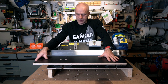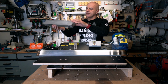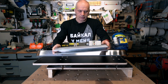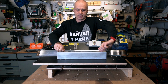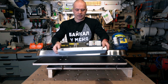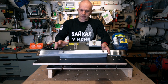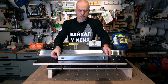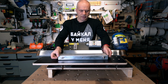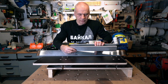The third upgrade is a grip, a hold for a runner. I've been using an aluminum profile. That's a two-piece aluminum profile. Both are angles, and they are made in a way that they have ovals here. I initially used 3 screws, now I use only 2 screws, and they are fixed with ovals, so it allows me to change within a range of 2-3 millimeters the width of the grip depending on the runner body thickness that I put in.